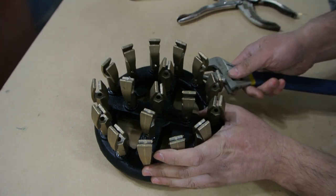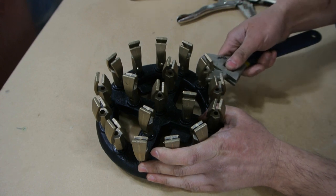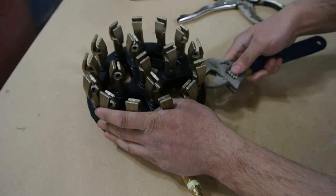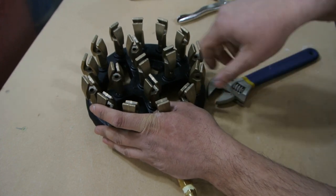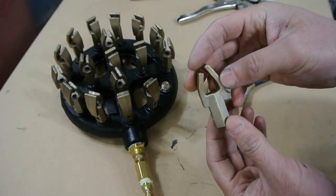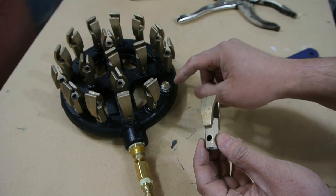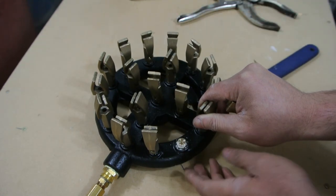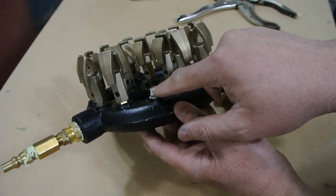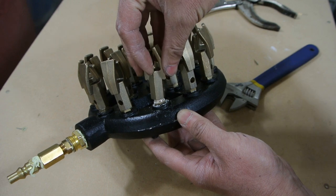These tips rotate, and I've rotated them all in, but you can rotate them any way you like. The tips come off — it's threaded here, and propane shoots out of the little tiny orifice right here. This part is threaded into the base, and then there are threads on the top. So this is a double thread: a thread on the bottom and a thread on the top. Then this threads into this, and that's what gives it a little degree of adjustability.